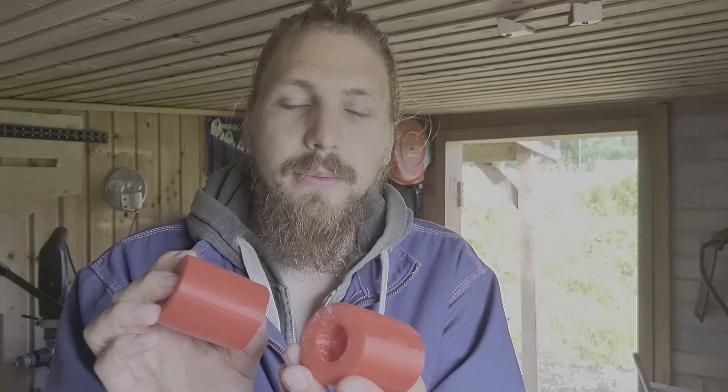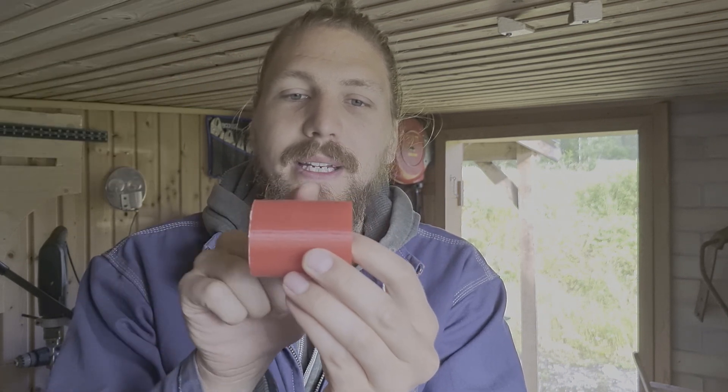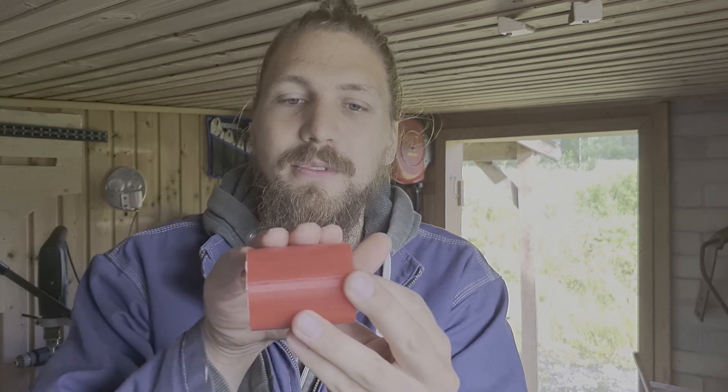I have designed these rolls in the 3D printer. They're designed to have a bearing at each end. I didn't design them with a straight surface — it's slightly curved, which helps align the belt to the middle and helps prevent the belt from sliding off.